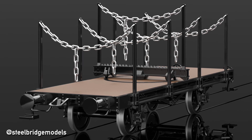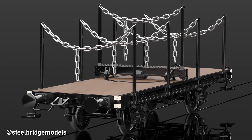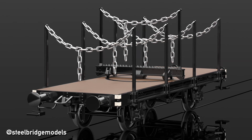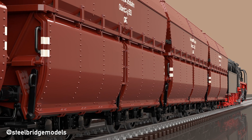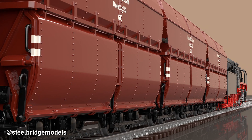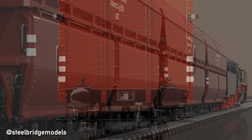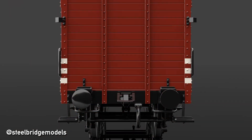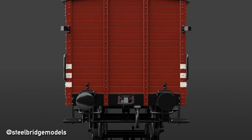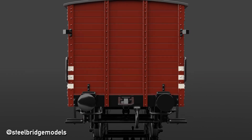For many years the most common markings were two squares, indicating a wagon which is not only piped but also features an actual goods wagon brake — specifically one that conforms to international norms and can therefore be freely used, including abroad. Three squares on top of each other were more prevalent on older wagons and describe a braked and piped wagon whose goods brake is of a non-standard type, therefore limiting its use.